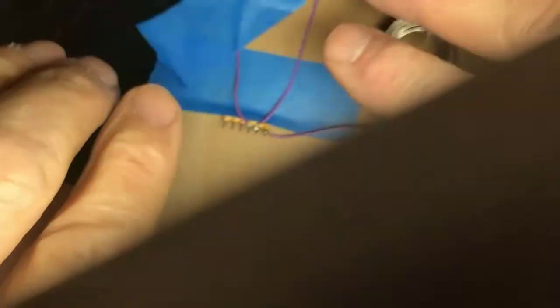It may be that all you can do is have half of a loop, but it's whatever you can do to make sure that it isn't going to move once you pull away with the soldering iron and the solder solidifies. That's the main thing, is no movement. Okay, again, I'm using the blue tape. I use my visor, inspect it, make sure it's not touching on either side.